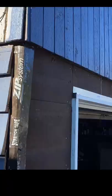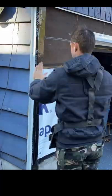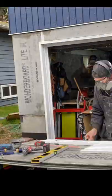You first remove all the existing siding. Then install Z-shaped flashing as well as Tyvek house wrap. Proceed to install cement board on the entire exterior and then apply red guard to waterproof all the boards.